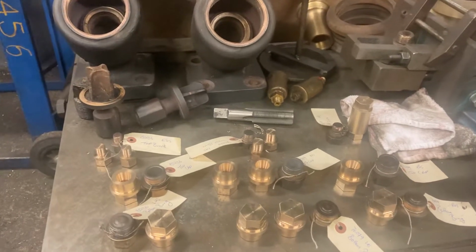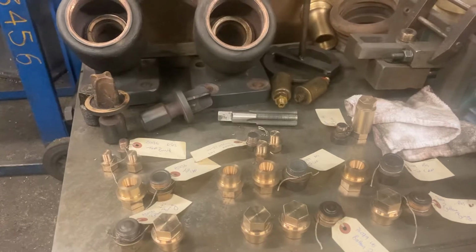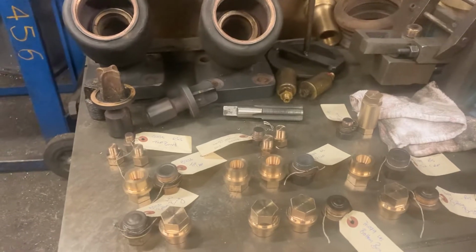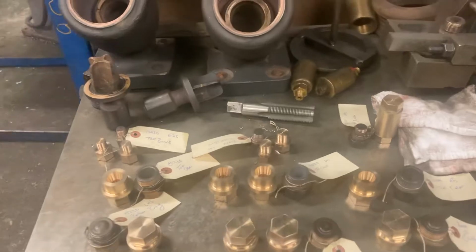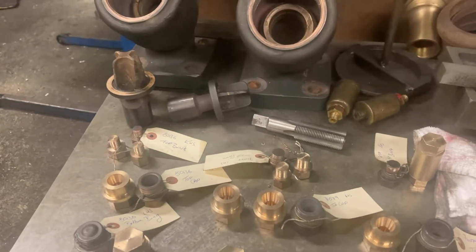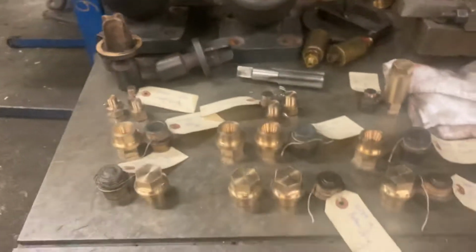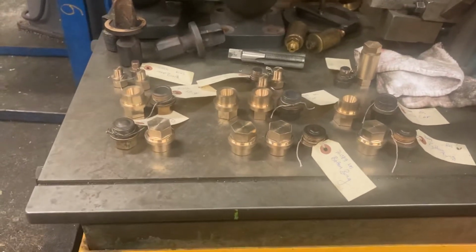But when Brian started poking and exploring and machined it to a pipe size, it wouldn't fit. And then we were discussing what on earth could be 5/8 by 18 TPI. And I said, well, the only thing I can think of is UNF, but that's hardly ever used. So anyhow, it proved to be UNF. Much to my amazement, we also had a UNF die in the stores. So Brian's busily on with making those tomorrow. Then he's just got the rest of those to thread, and that's another job that's done.